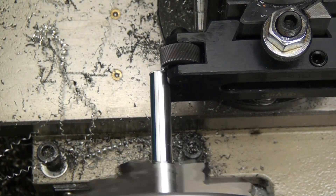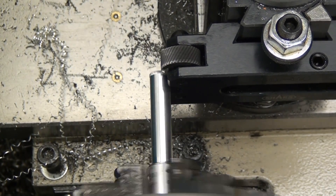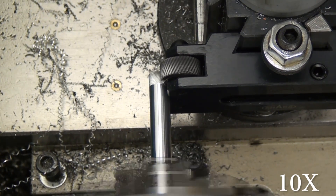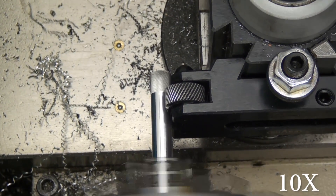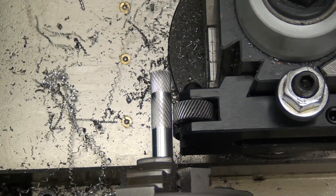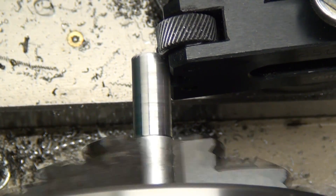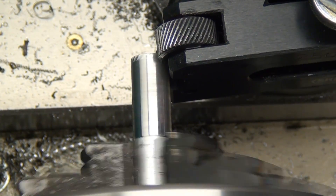In this pass I have the tool set up at 90 degrees to the work. I'm doing a 25 thousandth step of the cut and I'm turning at 150 RPM — this is as slow as my lathe can go. You always want to go as slow as possible because in a knurling process you're not really cutting, you're pushing the material. The bottom half is at 14 thousandths per rev, so I just wanted to show you that going faster is bad. Go as slow as you can.